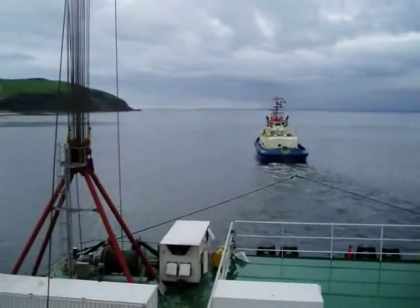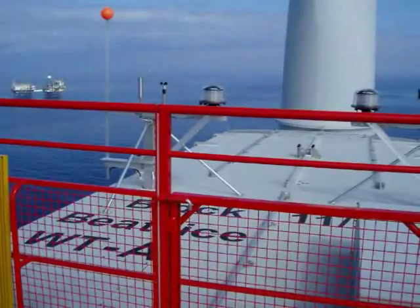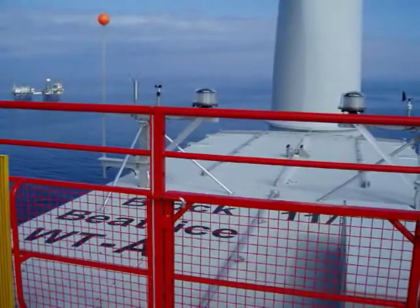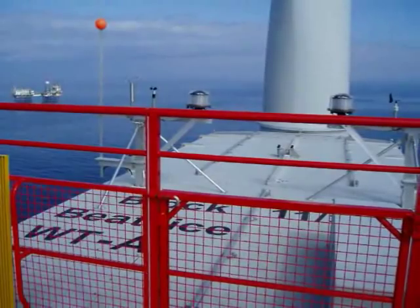In each corner there's a circular area — that's where you drive a steel pile into each corner, which effectively fixes the jacket substructure onto the seabed. Each pile is driven 35 metres into the subsurface. So that's your jacket now fully installed, ready to receive the turbine.